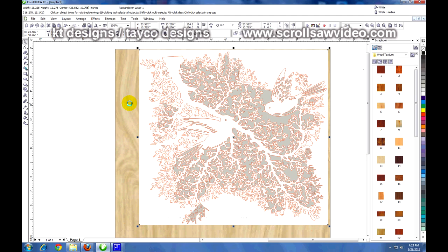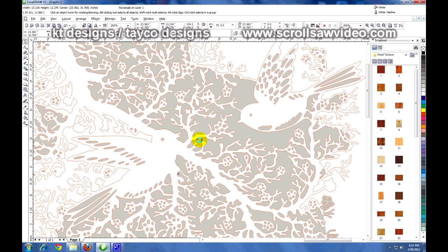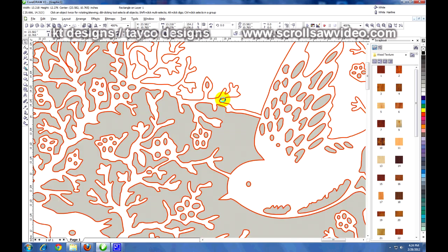Okay, the starter holes in these little flower buds, most of these are circles. So just a simple drill hole will suffice for most of these. But a few of these are going to be oblong, such as this. So I would drill the starter hole towards the center of this hole, insert the scroll saw blade, and rock it back and forth. Very simple to do.